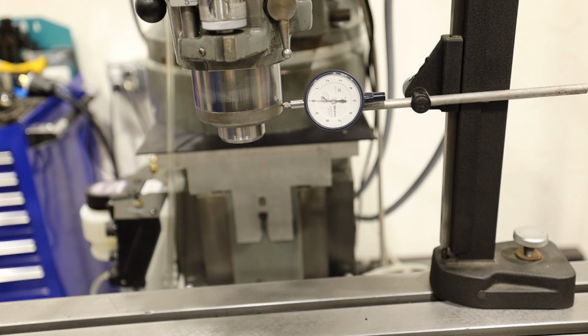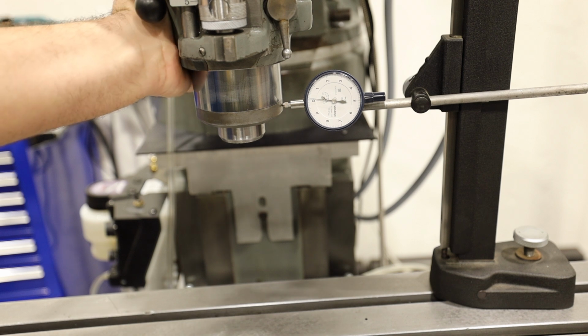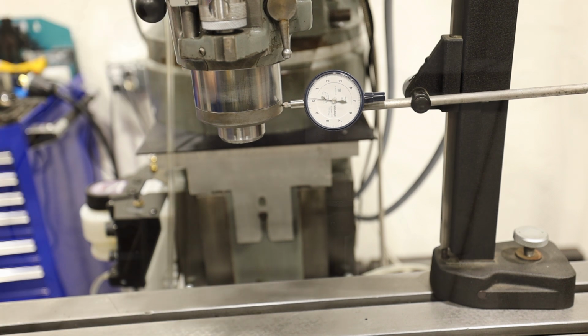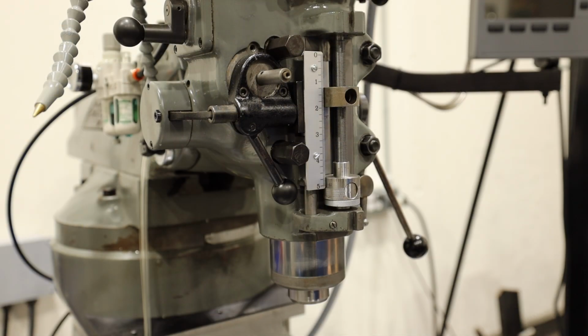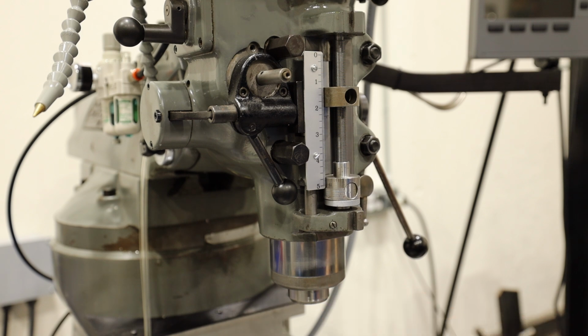And then here's a demonstration. We're just going to put about 5 pounds of load on here. We see we do get some deflection. Overall, we're looking for no more than 2/10 of run out from the inner taper and 2/10 of play when we put a lateral force on here, or when we put a force on from the bottom.